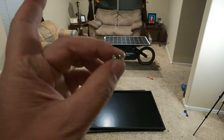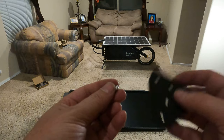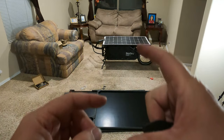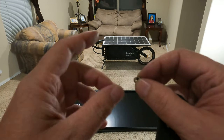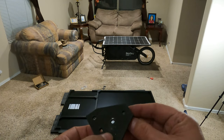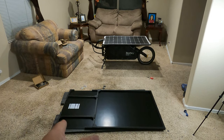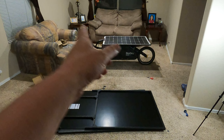The screws and T-brackets themselves are really good, but the T-nuts that come with them are total crap. You read about people cracking them in half in the reviews — sure enough with a tiny ratchet I gave them just a slight bit of torque and could feel them snapping. I'm going to have to replace all the T-nuts on all the brackets, because a cracked T-nut could eventually cause the whole thing to pull off.